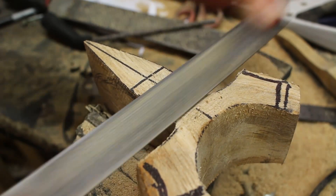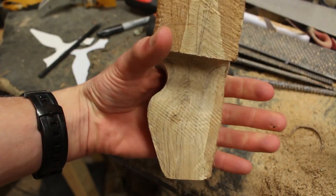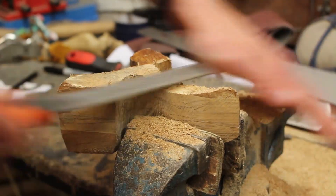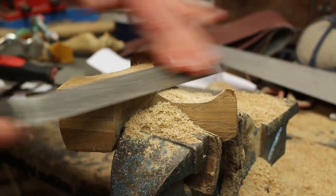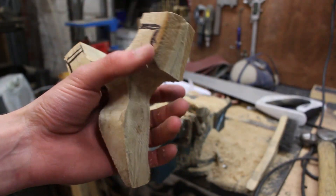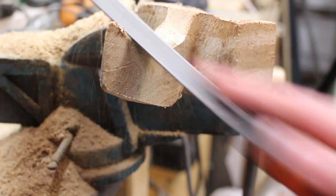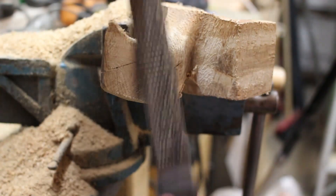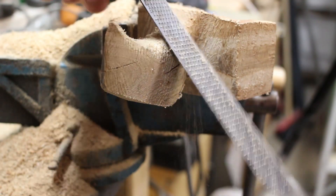I've found that something like this is really comfortable when you apply a lot of force on it. Once I've got both shapes at 90 degrees carved to roughly the right outside dimension, I then start to round everything over. I just squeeze the handle and feel where it's sharp and digging in, then round it over with the rasps until it's comfortable.